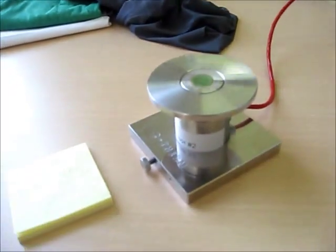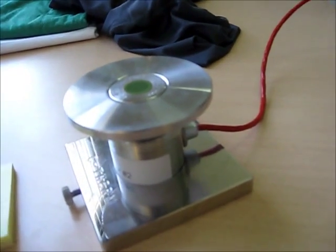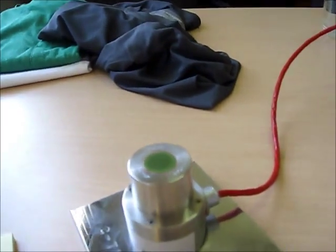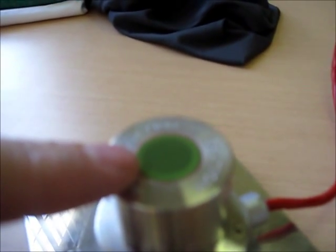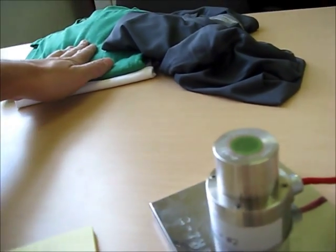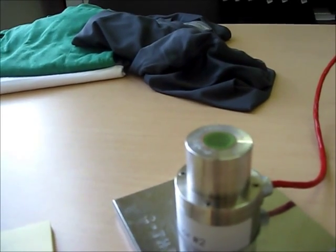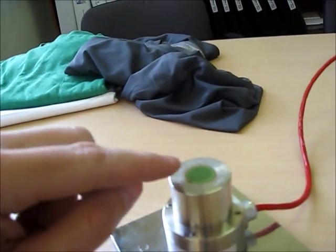We're going to be measuring these materials with our TCI thermal conductivity sensor. The sensor is based on one-sided interfacial measurement and the primary sensing element is this green sensor chip here. It's based on the same principle as how your hands can touch different types of materials and differentiate their thermal properties based on the buildup of heat between the sample and the sensor, in the case of your hands, or the sensor itself.